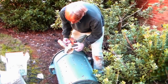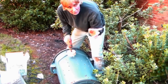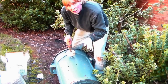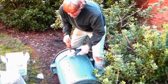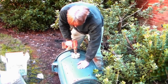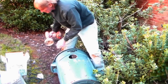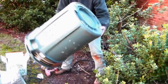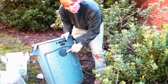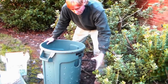One other thing we're going to do is drill a four inch hole right in the side of the pit for the footer tile to be added in the future, because I know this crawlspace is going to need footer tile. Right now the homeowner just wants the sump pump and a discharge, so that's what we're doing - but this will allow us to attach a four inch gravel perforated pipe later. We'll also give them a small piece of gravel perforated pipe to help water come in.